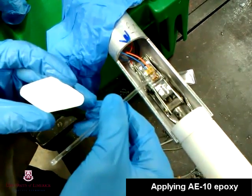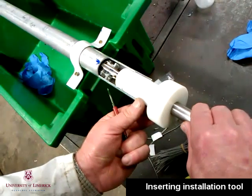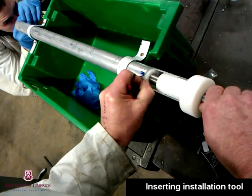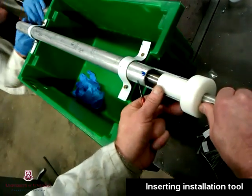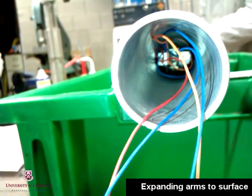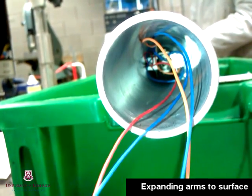On some occasions we found that the black PVC tape was left bonded with the strain gauge on the inside of the pipe. Once the epoxy had been applied to the top side of the strain gauge, we inserted the rod up to the required distance inside the pipe. We threaded the wires out the front of the pipe and let them fall by their own gravity, which helped put a small tension on the wires, dragging them forward as we inserted the tool. Once the tool had been inserted the correct distance, we twisted the screw to expand the arms and pressed the strain gauges against the side of the pipe. We let this sit for 24 hours overnight to allow maximum time for the curing of the epoxy. The following morning we would come in and retract the arms.